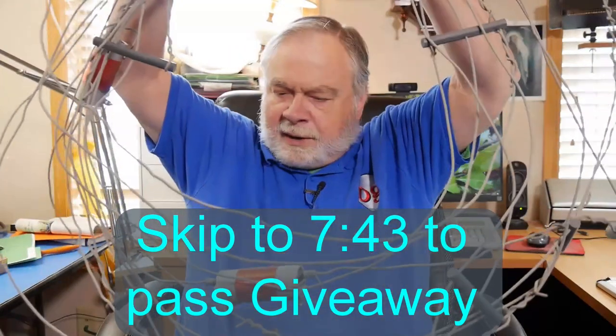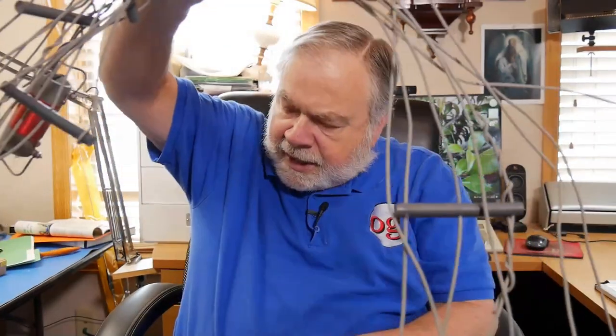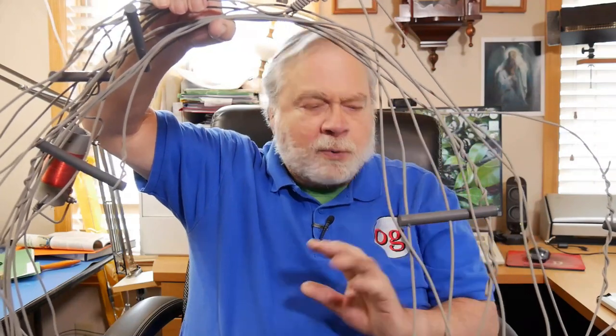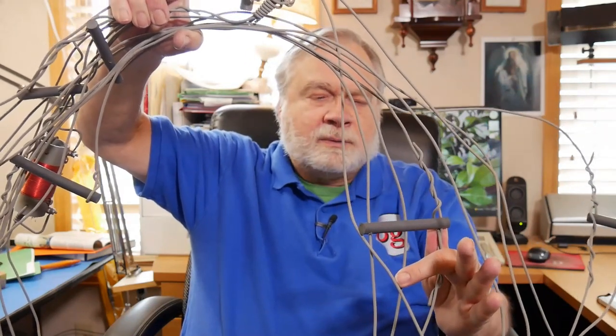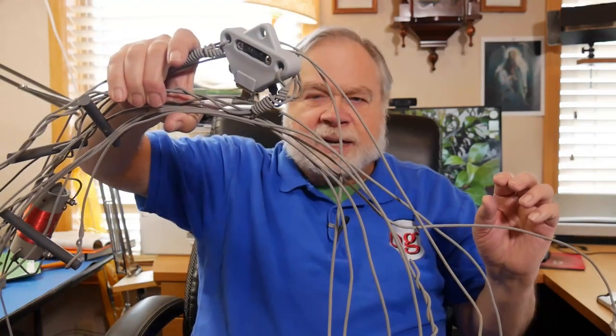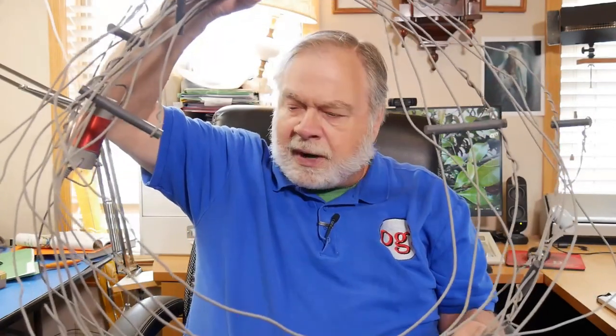Giveaway number 4 is coming up, and this is it right here. It's an antenna by Alpha Delta, model DXEE, and it has traps for 40 and 20 meters. You can select the lower half of 40 meters to work FT8, or the upper half for sideband. It also covers all of 20 meters and the important part of 10 meters. It's a fan dipole plus a trapped dipole — a very nice antenna. It's pricey but built like a Sherman tank — very, very sturdy. It is only 40 feet long and yet will cover 40 meters, with nice gray wire that's hard to see.